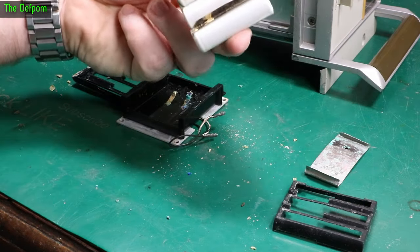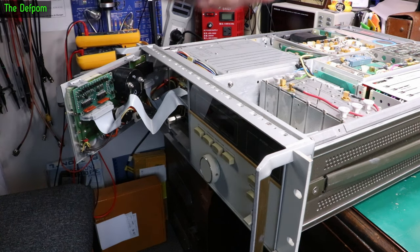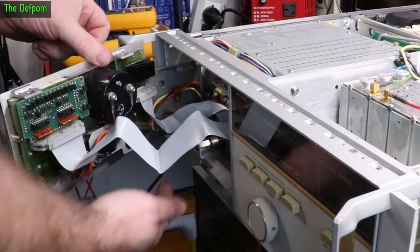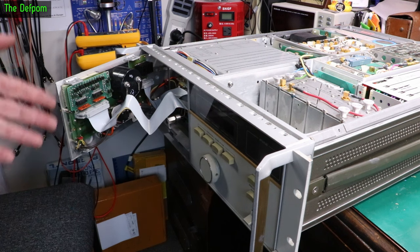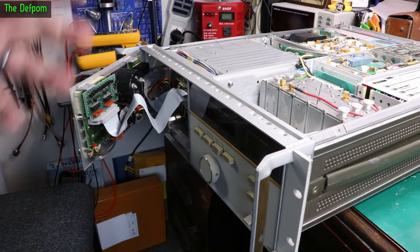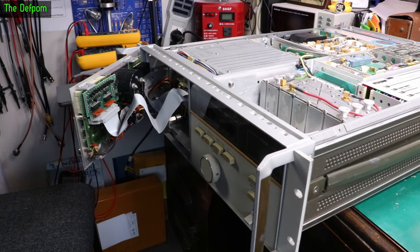Replacing with exactly the same setup? Probably not. Whilst looking through the manual I saw a picture of these front panels folded out. There are screws here which you take out — this end can slide out, you release the nut off the end connector, and then it allows you to slide the panel open. There's an issue with the switches being a bit dirty on the front panel — I want to get to the back of the switches and give them a clean. It's just a sliding contact on the back of the circuit board, gold-plated as well. A quite nice way it folds out — four screws, two on top, two on bottom, take the nut off and pivot it out.